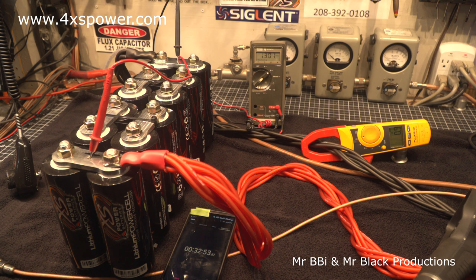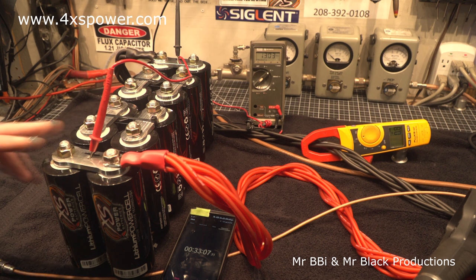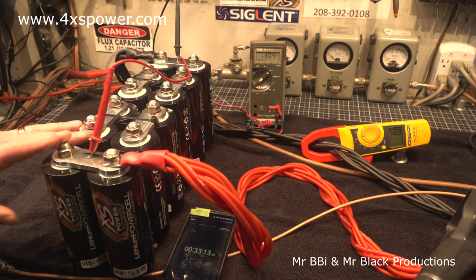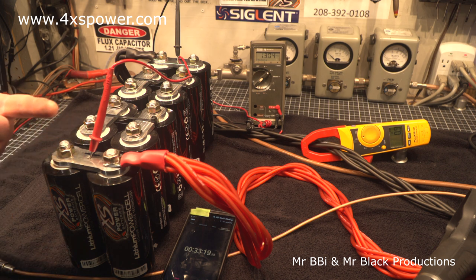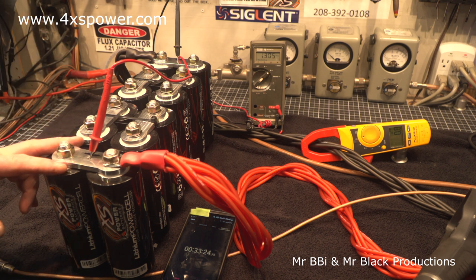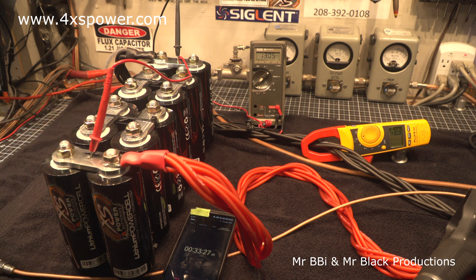The other thing that I think is really quite cool about these batteries is that you can go and take like a 50 amp, let's say like Astron power supply, spend $500 on this, $550 on this, hook your Astron to this, use the Astron to charge it. Once the battery is fully charged, it doesn't represent a load to the power supply. So one, it's not going to burn up the power supply like it would on a regular lead acid battery. And two, you're not going to burn the battery up. Think about what I just said. It'll sink in.